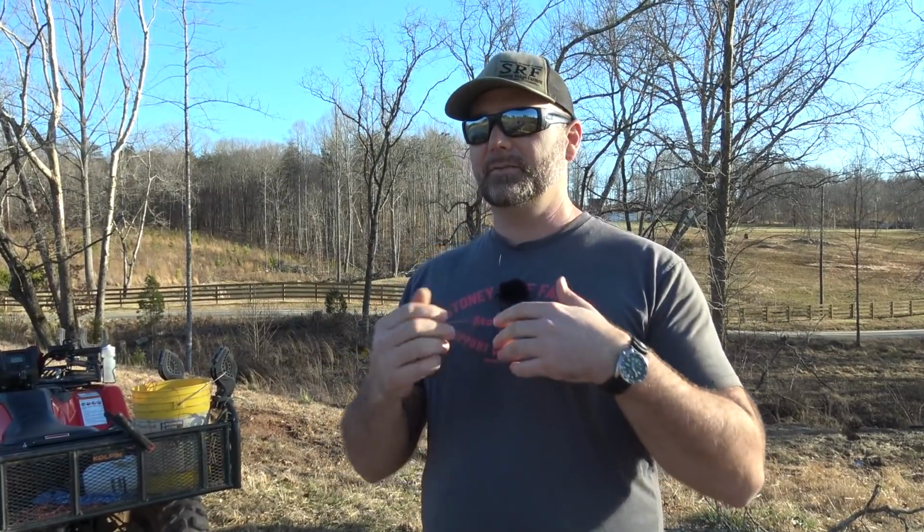I solved that problem by getting a little drill pump, and about every 3 days when it was over 90 degrees, whether I needed to or not, I'd hook to that valve that you saw me turn off and just run it constantly, and inevitably it would burp out a little bit of air. So that was the maintenance that I had to do. If we went on a trip 4 or 5 days, a week out of town, I could do that, come back, and the cattle would still have plenty of water.